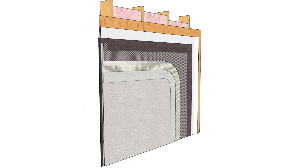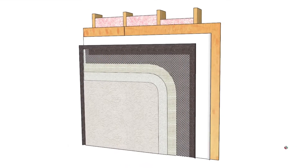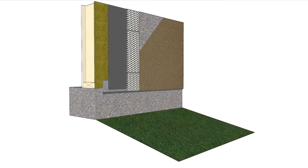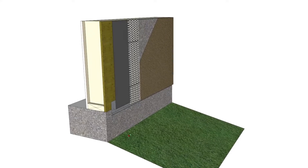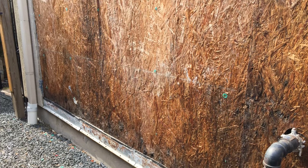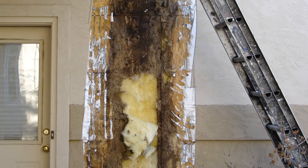The conventional way that stucco has been installed for years is the problem. Most exterior stucco walls have a buildup of half-inch plywood or OSB sheathing, a weather barrier like Tyvek house wrap or asphalt-impregnated tar paper, a metal lath to attach the stucco, and then a three-coat stucco layer. Stucco is a reservoir cladding, meaning it absorbs water. If we can agree that stucco acts as a sponge, then any surface behind it will get wet — there's just no avoiding it.